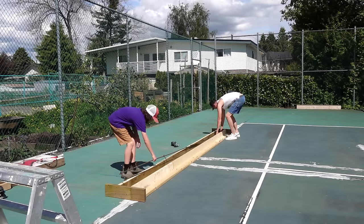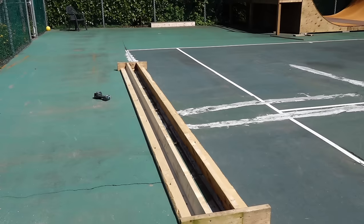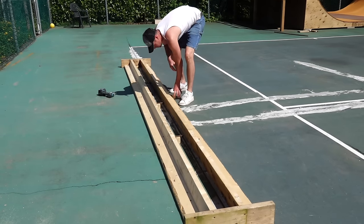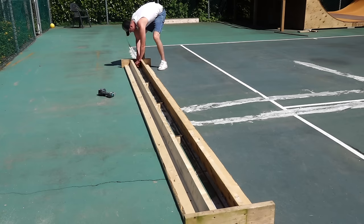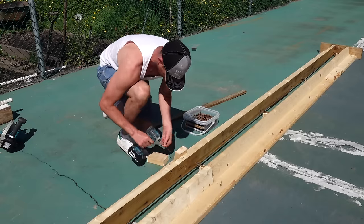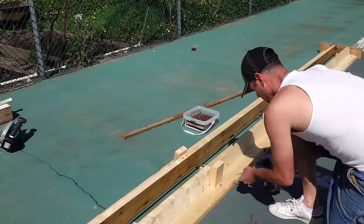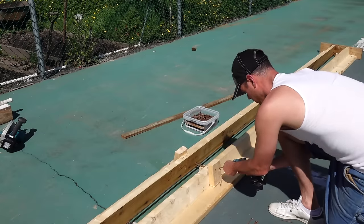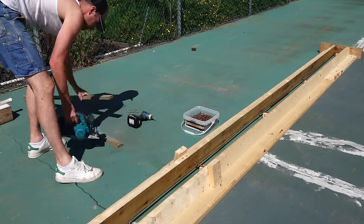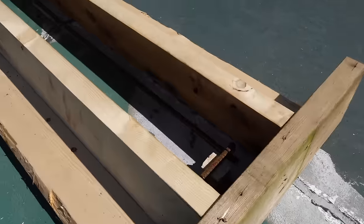After placing it in the form I propped the rebar up with little blocks about two inches off the ground, and made sure the rebar wasn't touching the edges of the form anywhere — you wouldn't want the rebar showing on the outside of the concrete and rusting over time. Next I screwed little spacers on the outside of the form and then screwed a stick across the top just to stop it from spreading apart when the concrete is being vibrated with a hammer.